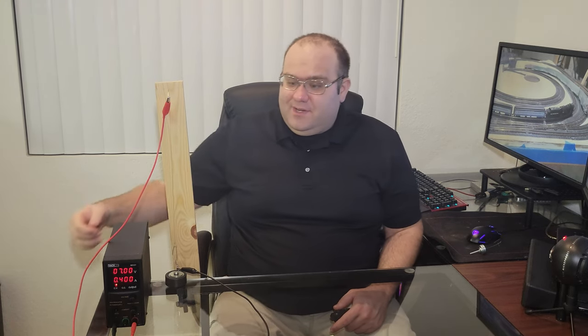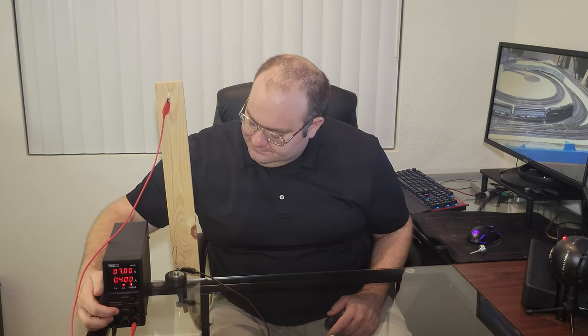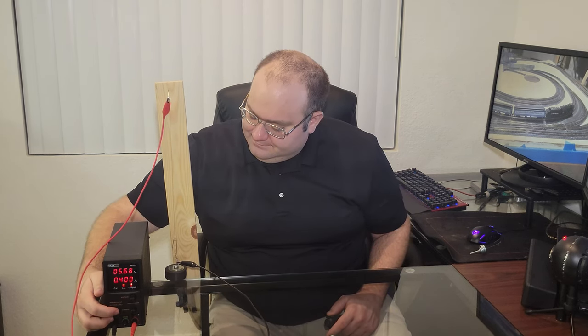So why use muscle wires instead of motors, servos, or solenoids that are more commonly used? Well, that's because I believe muscle wires offer advantages to us modelers if used correctly. The wire is very thin, so it can fit in much tighter spaces, and when warmed up slowly, they can move in a very gentle fashion. Let me demonstrate with this thicker 6-thou wire. Try doing that with a solenoid.